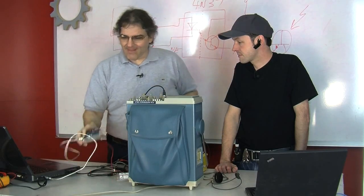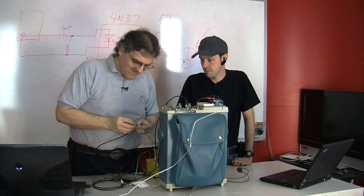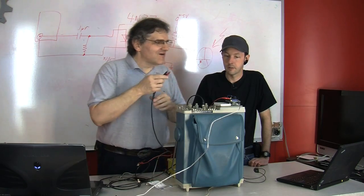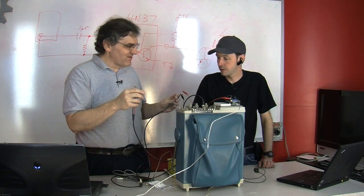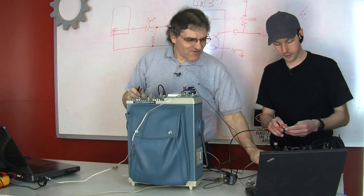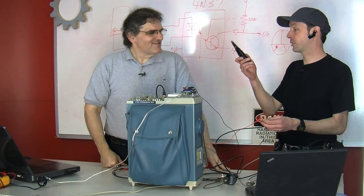If you have something you want to deal with, you'll need a global variable, which is what we're using. I've set up an interrupt to increment a counter. At the start of the program we zero it, and whenever the interrupt fires it increments the counter by one. We let it count up for a second, and then you've got your counts per second — we'll display it often.